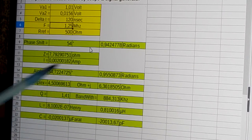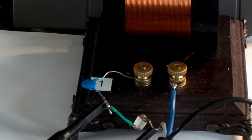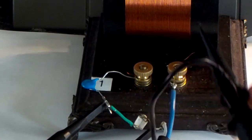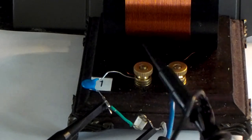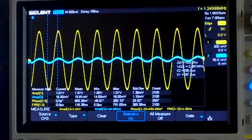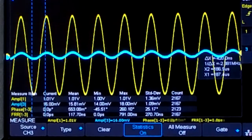What I want to do now is tune this to the 50-ohm impedance of our signal generator. The reason for all this impedance matching is to answer the question: when we add extra components for impedance matching, are we still able to get the same output voltage from our tank circuit? That is most important when discussing the resonant transformer concept. So I also want to measure the voltage when connected directly to the signal generator and see the consequences of impedance matching. I am going to connect a ×100 probe to the tank circuit to see its influence on our signal, which we must account for before doing the matching.